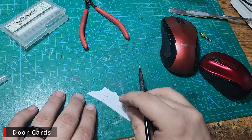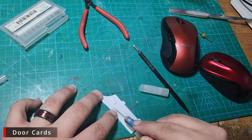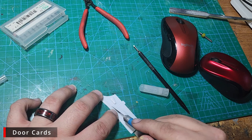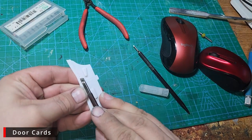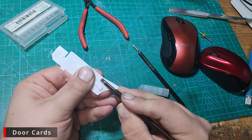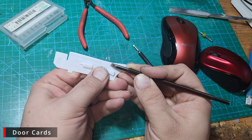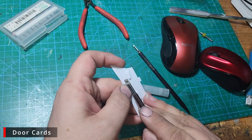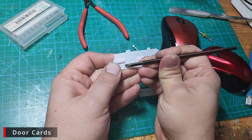On the back I found it was a little easier to use the hobby knife and lay the blade down flat so it kind of cut across while staying in the groove on both sides — it's hard to explain, but it just worked out a little better back there. There's a section of a handle in a shallow spot, so I took a small chisel and cleaned out that hollow area so it didn't look like it was standing up too much. You're not really going to notice it once the new window handles are in place, but I wanted it cleaned out a bit.